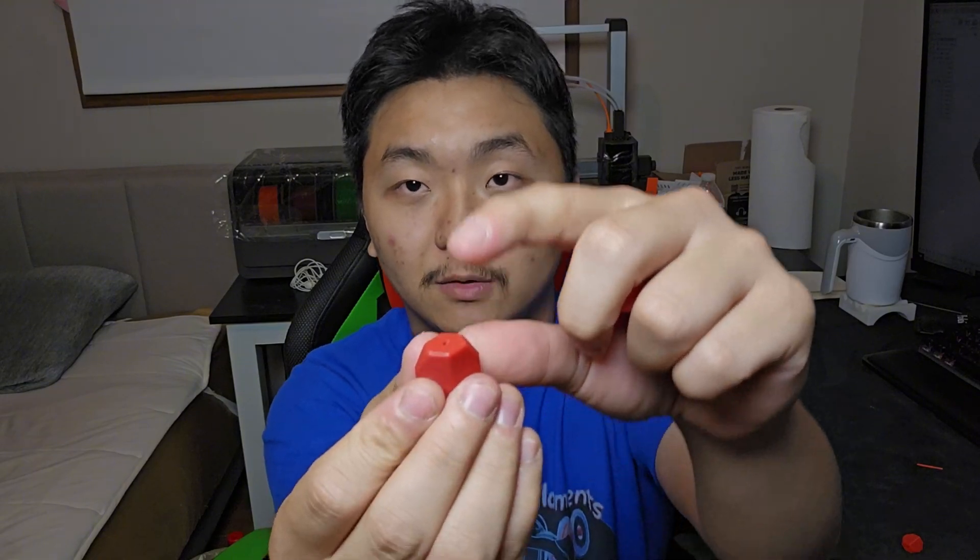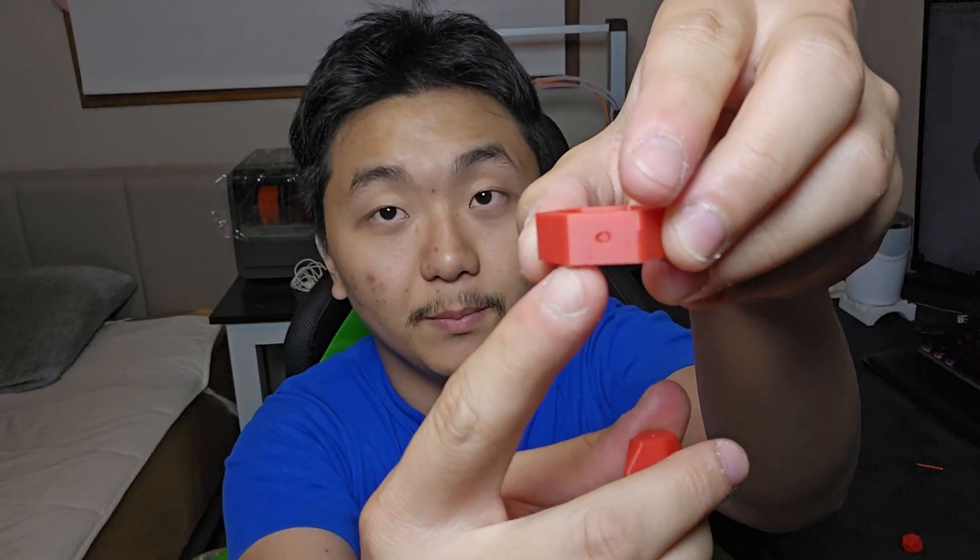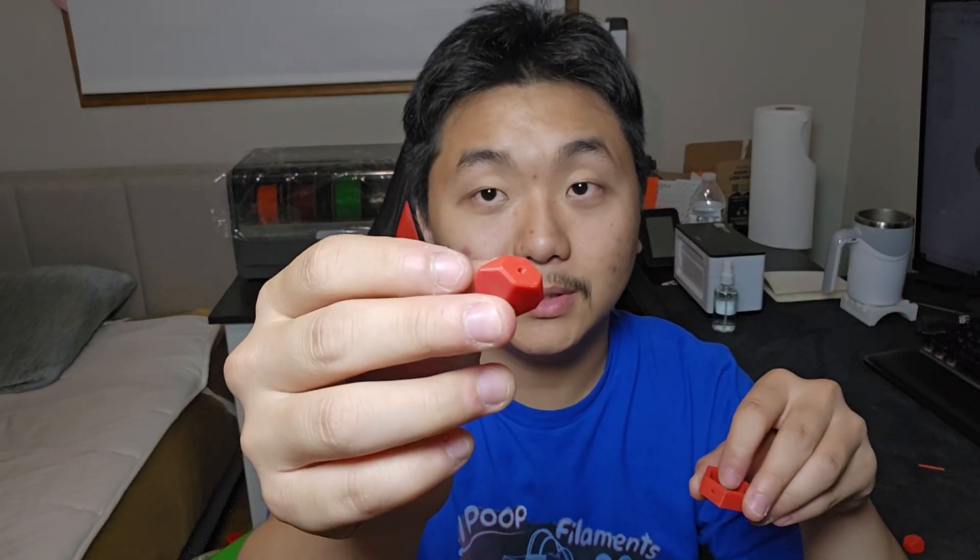This piece was printed like this, and this piece was printed upright with the hole up here. So the hole is printing upward, and on this one the hole is printing in the middle of the piece. It's not printed vertically. A while back I was experimenting with the first layer, and I think this has to do with diameters with circles and printing orientation.